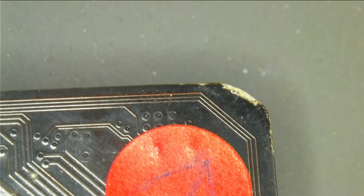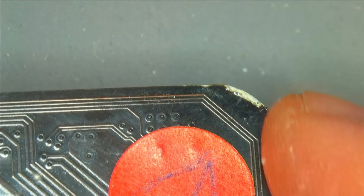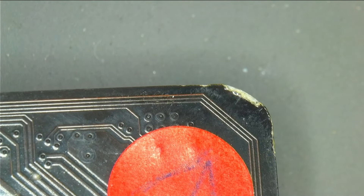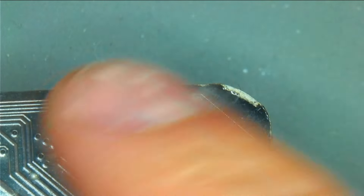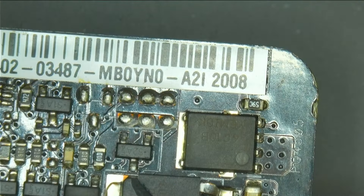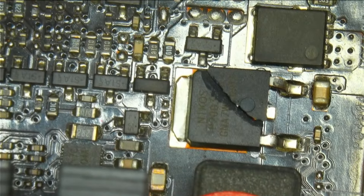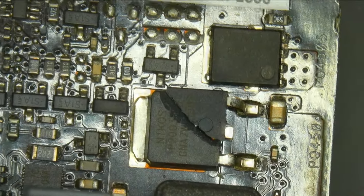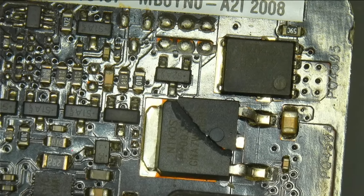The back side has basically nothing except a very little bit at the corner, but that's just ground for the PCB — it doesn't matter. The last traces are these here, and there are no internal traces going back there, so that won't be a problem. Just like on the top side, there's no damage there. We need to find out what this component is — well, obviously this is some kind of MOSFET that handles a lot of power.